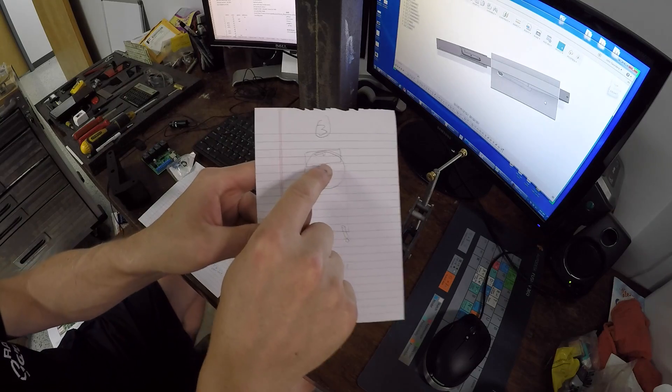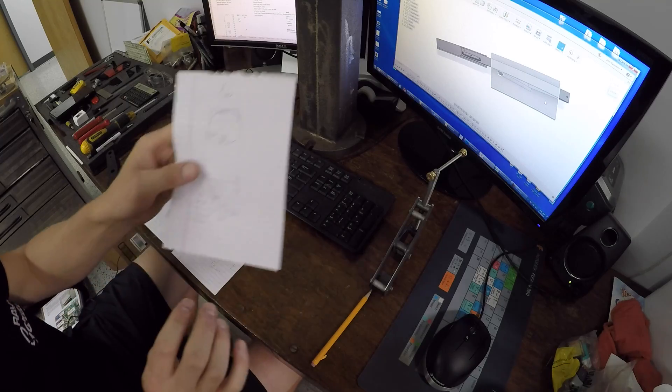When we get to the engraving position at 12 o'clock, I'm thinking we use one of these eBay electromagnets hooked up through an Arduino. The platen should hold the part somewhat securely — stepper motors have good holding torque when idle — but I figure there needs to be some play to pick up and drop the part, so the electromagnet will lock it in place and then release it easily into a feed hopper.